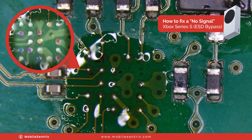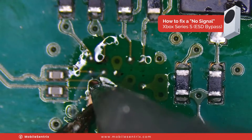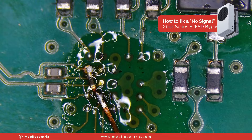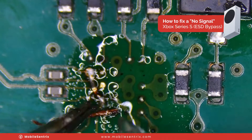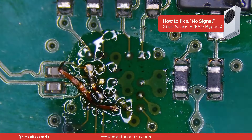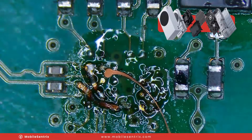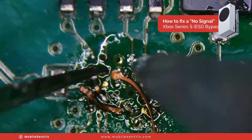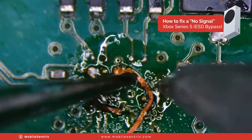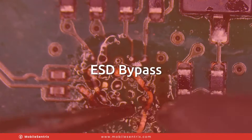Basically I need to make sure that these wires connect solidly to their corresponding pads but don't bridge together — we don't want anything to carry current from one jumper to the other. It's okay if we cross lines; we just need to make sure when the time comes to apply a UV mask, we can isolate the jumpers from each other, guaranteeing no shorts in the future. This process is known as an ESD bypass.